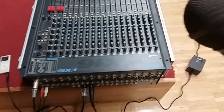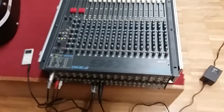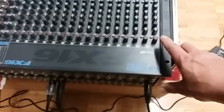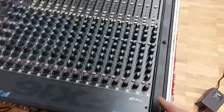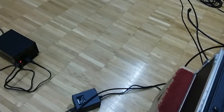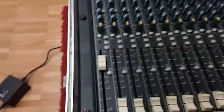Now I am going to hook up a mic. I have got this SM-588SDX, kind of an old speaking mic. I am going to put this in channel one. Slider is down — verifying that my slider is down. I am going to have my sensitivity up to about 50%, and my mic should work at this point. Doing a quick 1-2 check — I am getting sound out of my speakers, so that is cool.